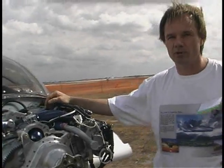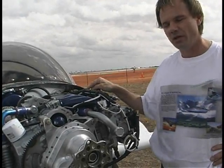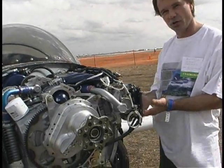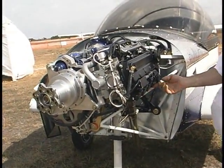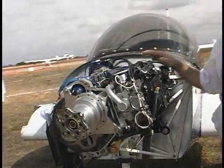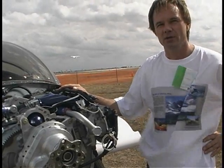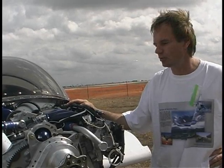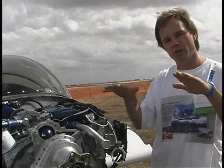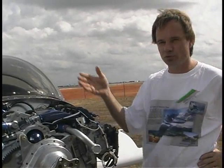How are we dealing with fuel — is it injected or carburetor? It's fuel injected like the 2009 car. There's no change to the actual fuel injectors themselves. The ignition is a coil-on-plug ignition with an individual coil for each spark plug. The redundancy comes in the ECU — the unit is not the one provided by Honda; it's a unit that our company sourced and manufactured, completely dual, with two complete separate ECUs in one case using individual inputs and outputs to run the engine.